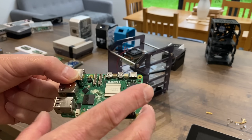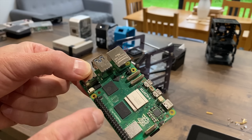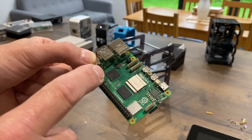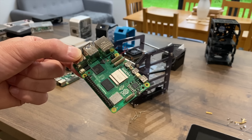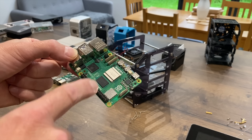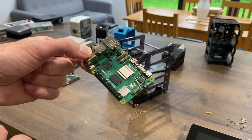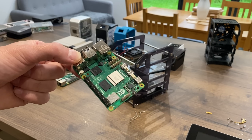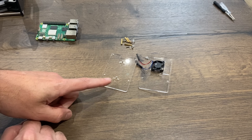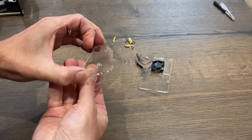I hope manufacturers are going to start sending me cases like they did before — I don't know how quickly they get design details on the Raspberry Pi 5, but obviously there'll be changes that need to be made. Regarding the PWM fan: the official fan uses a specific connector which will show up in config.txt. When you connect PWM fans, they plug in with three cables and automatically come up as settings in config.txt, unlike the Pi 4 where you could pick pin 14 to enable the fan.